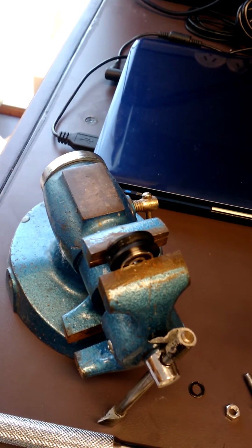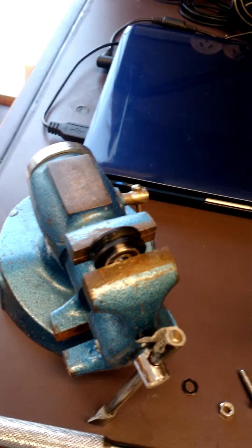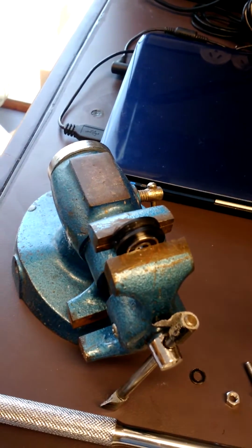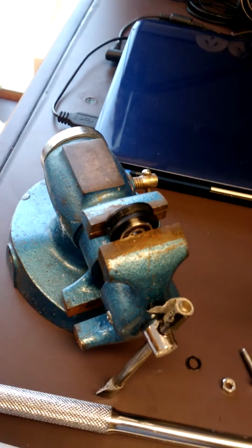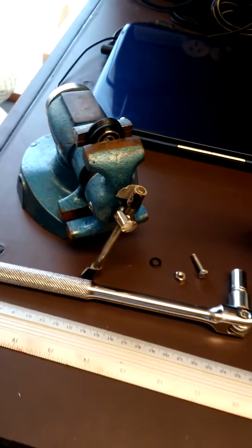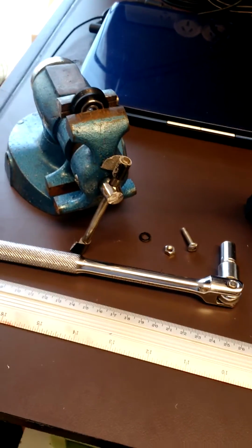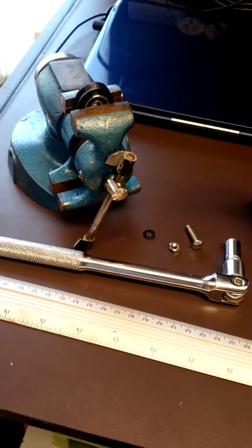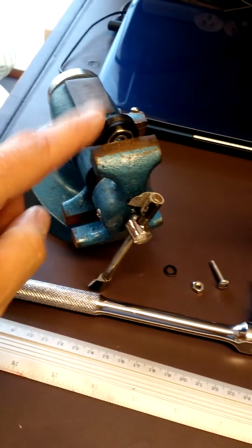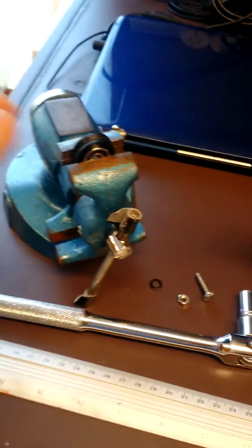I will either order some new ones or get some new bearings or something, but that seems to be the cause of some significant movement in my setup. Again, spent quite a bit of effort in tightening the V-wheels as much as I could, and stiffening the plate as much as I could, but on examination these bearings seem to be the cause of about 90% of the movement. And again, it's quite apparent.